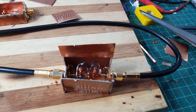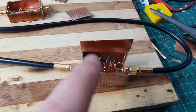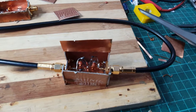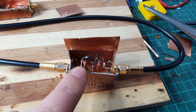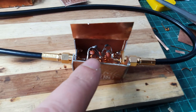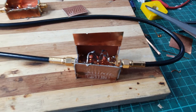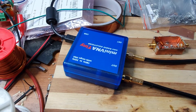I also had a very bad surprise with some ceramic capacitors — they were quite a lot off in value with high tolerances. So I had to add some supplementary ones just to bring the filter to the point it was designed for. I'm using Mini VNA Tiny for this measurement.